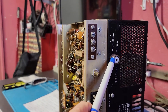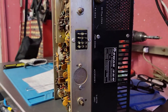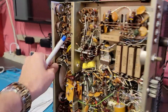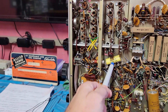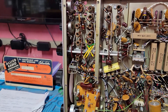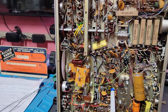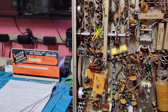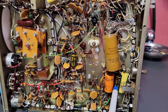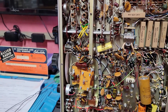Possibly that was changed at some point. The connector looks good. VFO box unit looks good. Everything looks pretty clean for the most part. I don't know if these are replacements or original, but I'll use my checker on them. Ceramic caps, you don't have to worry about those. Here's a small black beauty that I'll replace — I do have that in stock. This one I'm concerned with because I don't have it, but I might need to order that one.